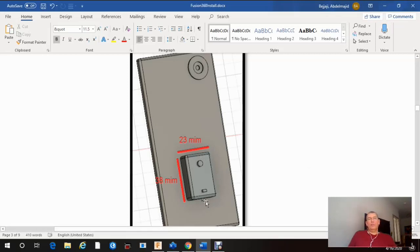And I forgot to tell you, but in the middle bottom here there will be a small hole, diameter of 3 millimeters. So this is where your audio jack wire is gonna come from. So I need a hole here, okay? And one more thing, we will have on the other side of the plates of this box, in the center, going from the middle bottom to about, let's say, 15 millimeter. So from bottom to top, I want you to make a small circle, and I'm going to show you how to do it anyway. So this is just a description of the enclosure you'll be making.